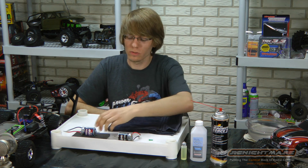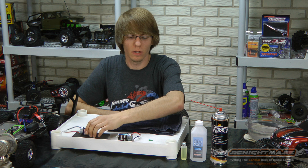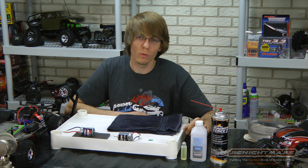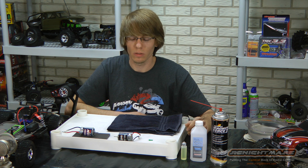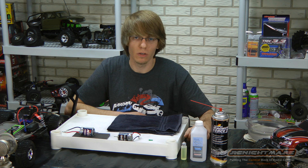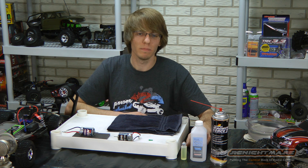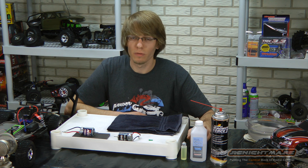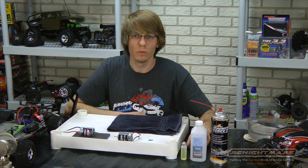Now we will do the same procedure to the motor that we broke in out of the water — make sure you clean it thoroughly and re-lube it. It's important to remember: every half hour to hour run time, re-clean the motors and lube them afterwards. If you want to get the most life out of your motor, keep it clean inside. Most of us run in pretty dirty conditions, so spray it out and you'll have a great motor that lasts a long time. That's it for this tutorial. If you guys have any questions, comment below or post up at RC Nightmare Forums.